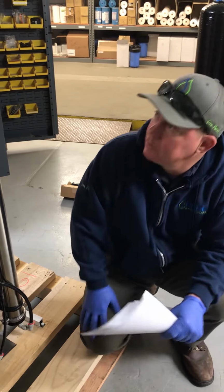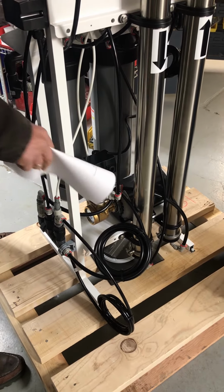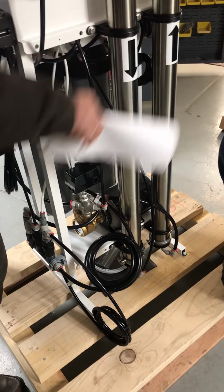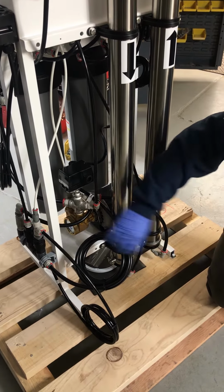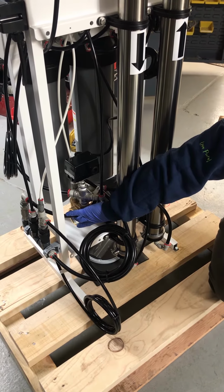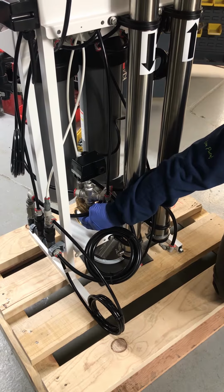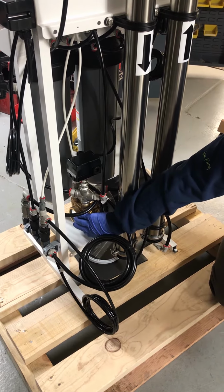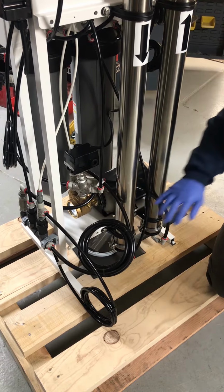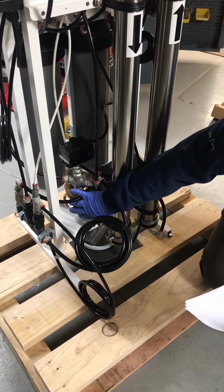The theory is, just so you guys know, the pump is taking the 60 psi and increasing it to 150, so that the water goes through the membranes at high pressure. It makes more water, and they're more efficient at 150. You're typically going to replace your pump and motor in unison. If you have a rattly bearing in the pump, you'll hear it. If you have a problem with the pump, you're going to want to change the motor and the pump. You carry all that in stock, so if there's a call, you'll throw it on your truck.